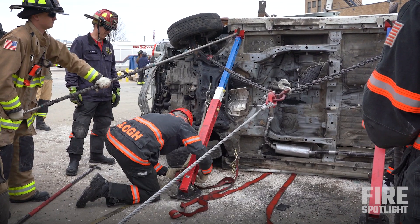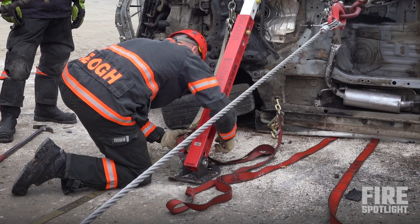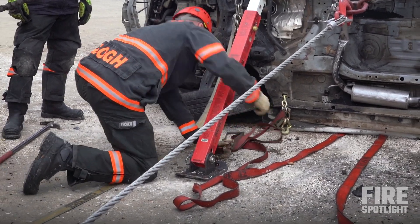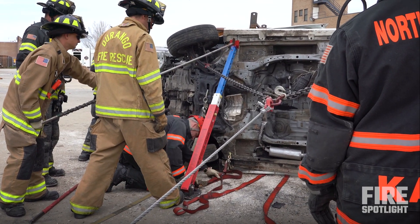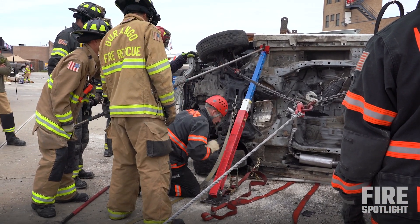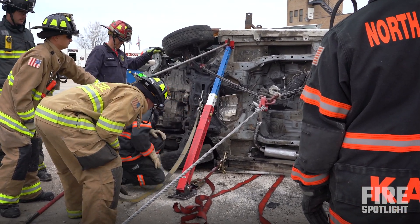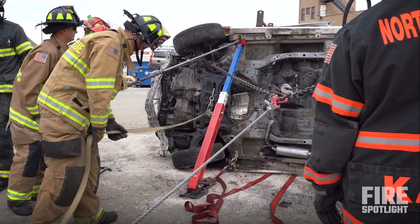You've got a lot of slack in those ratchet straps. Hold the tension at the bases. You no longer need to worry about the floor bases — the ones on the ground, just hold at the tip. Go ahead and pull straight in there and tighten those ratchet straps, just nice and snug. Doesn't have to be any more than that. That's good because we're pulling back into this system — this is called a tieback. It's pulling into those struts.